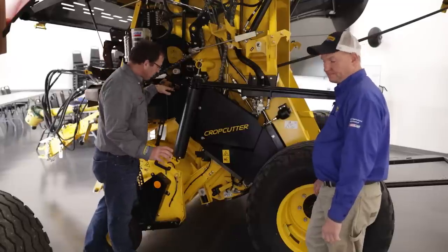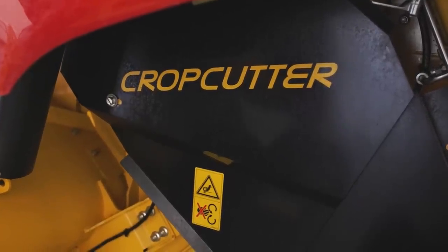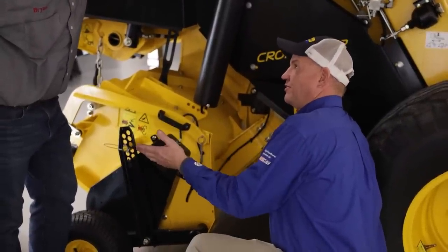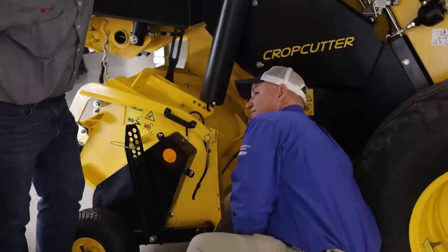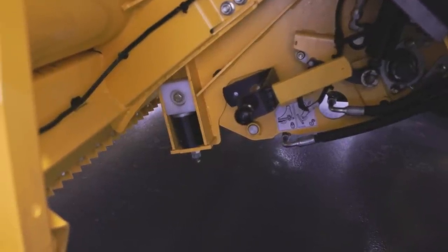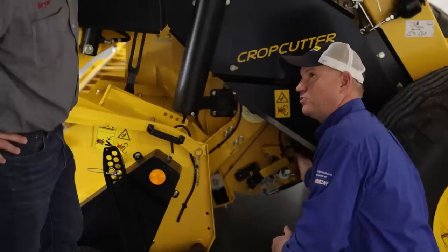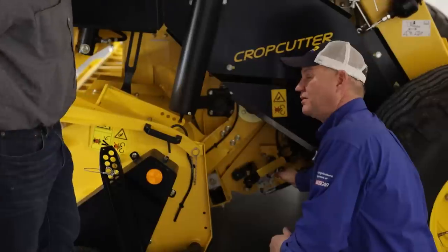Back on the side of the baler — this is a crop cutter baler with knives in the chamber, and it has a drop floor that New Holland refers to as their active drop floor. Nobody does a perfect rake job all the time, so if a slug does come through, this ISO mount rubber bushing will compress up to 10 millimeters. We pull crop through under the rotor, up against the drop floor — and the cylinder is actually mounted to a spring, so the cylinder will move down as well and let the crop flow through. That floor will actually push back a little to let the slug work its way through.